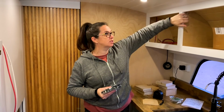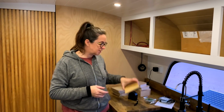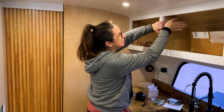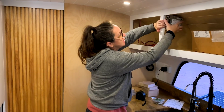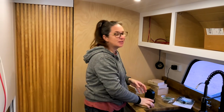All of our upper cabinets are face framed cabinets, which means there's a recess back behind these frames. And so what we had to do was make some spacers to fit in that gap and give us a place to flush mount these hinges in here to fake a frameless cabinet for the hinges, but still working with our face frames.